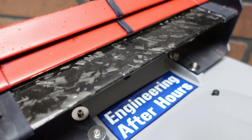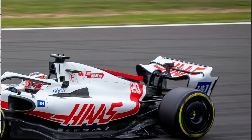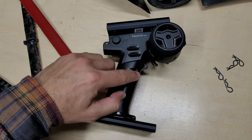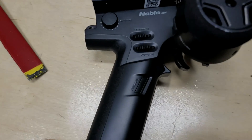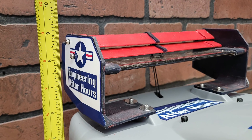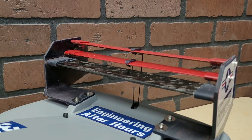The car I built uses a triple element rear wing for a lot more downforce, unlike the dual elements you see in Formula One, but the overall concepts are the same. I can activate this DRS by pressing a small button on my remote, opening the second and third elements and hopefully shedding a bunch of drag. What you see here is the high downforce position, and opening the elements is the low downforce, low drag position.